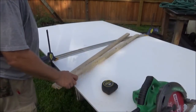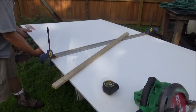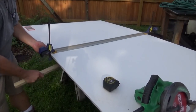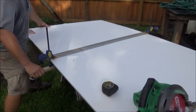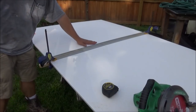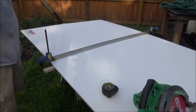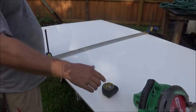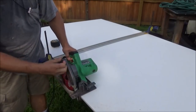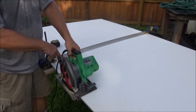I've got a couple pieces of scrap from the shop. I'm going to bridge the plywood over these two pieces so I don't cut into the nice lumber underneath. These are sacrificial pieces — if they get cut, that's no big deal. I have some finish grade lumber under there. If you've got some old sacrificial 2x4s, just set your blade depth where it cuts through but not too far — about a quarter of an inch through, then lock it down.